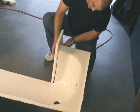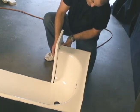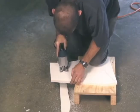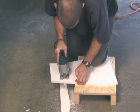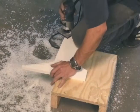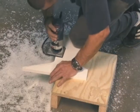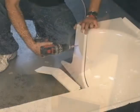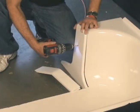Now we begin measuring our end caps. We use a special marking tool to mark the end caps half an inch proud of the tub wall. Then we cut out the end caps. We use a router with a 3/8 inch round-over bit to finish the end caps with a smooth rounded finish. Then we secure them into our end plugs.